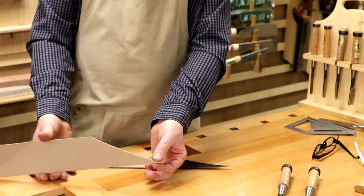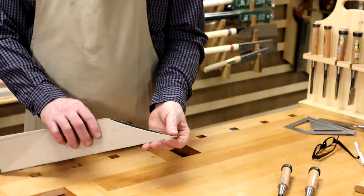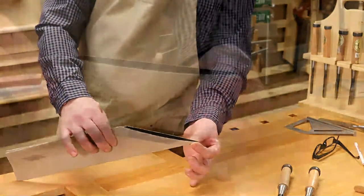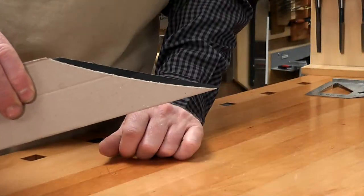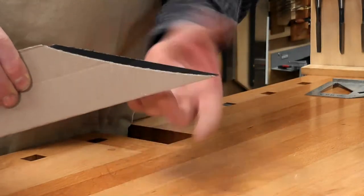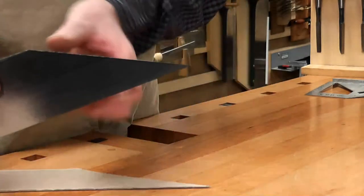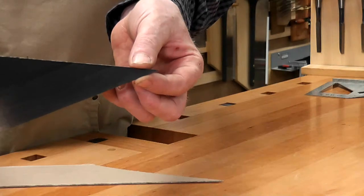It actually makes the cutting tip very weak because you've got that curve coming down. If you do a straight bevel, which is how they come, let me line these up. Can you see the blacking behind there? Let's have a look on three a minute. Okay, there. Look at that extra material. By having it flat instead of hollow, you actually gain more material on a 25. That adds more strength to this very point. Okay, so the hollow grind will make it weaker. If we go flat grind off a waterstone, diamond stone, you'll get more edge here, more support, stronger tip.